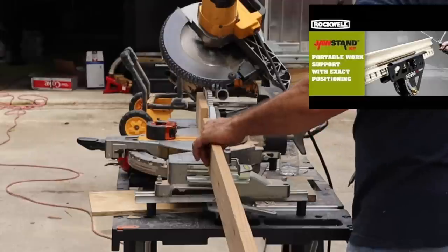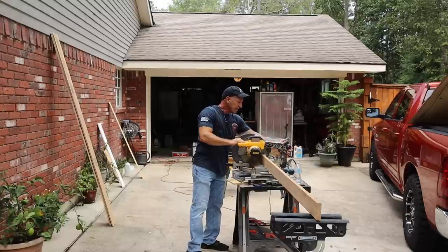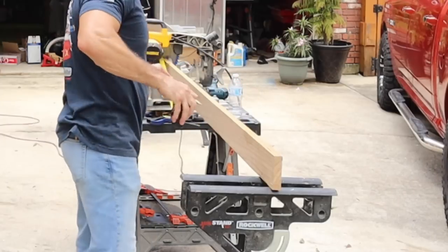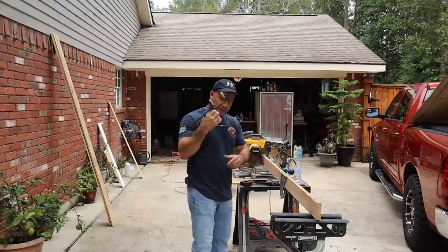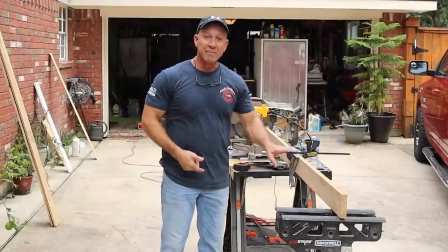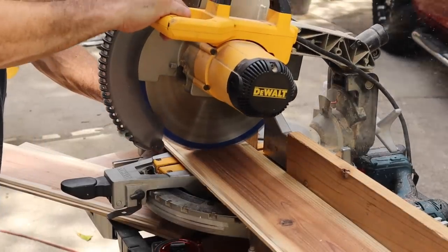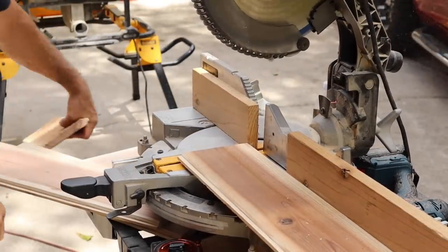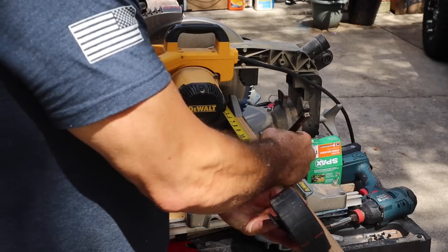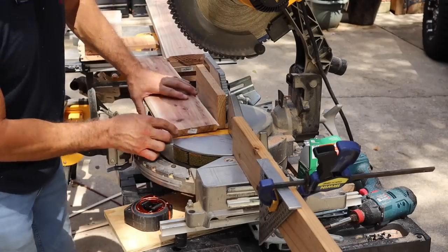The good thing is I have my stand over there to hold up that end. I only need one screw in here — I can lock it in place and measure off my blade. I need three boards. Now I'm going to put my clamp on. I'm using my speed square here — one of the most useful tools you'll ever have, along with your tape measure. You can't be without them if you're doing any type of construction. I need 15 inches for my cross members, and I need a good bit of these. If you have a bad end, clean that up right away.